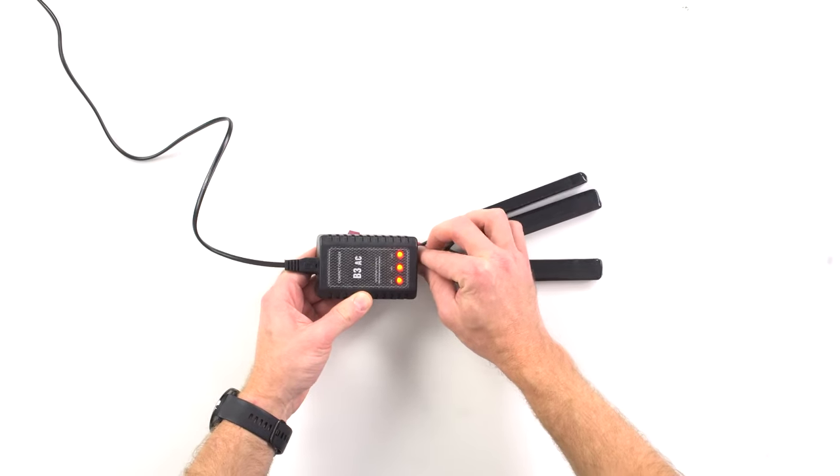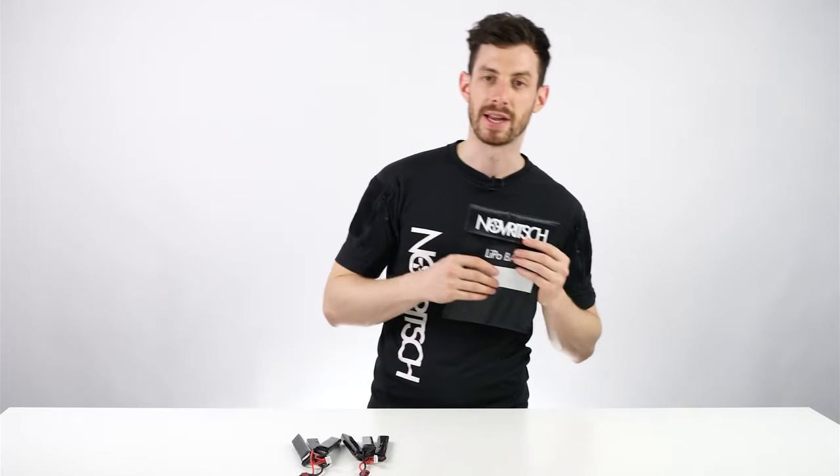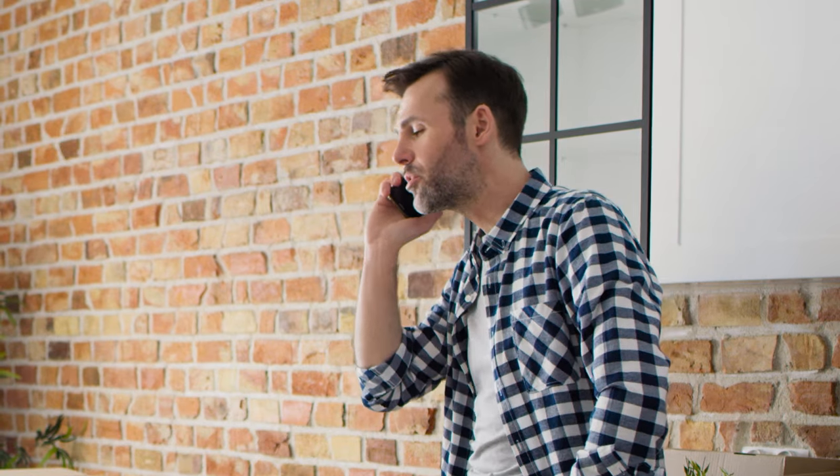Don't leave your batteries unattended when charging — connect them in a safe area with nothing flammable around, leave them in a LiPo bag, and disconnect them when the charger indicates they are full. In case of fumes or a fire, you probably failed at something mentioned earlier. We actually called the local firefighters and they told us the best way to handle the situation: hold your breath, open the window if possible, leave the room as fast as possible, and call the firefighters immediately. If there is time and opportunity, submerge the battery in a bucket of water. I would also recommend reading all the LiPo safety rules on our webpage — you can find the link in the description.